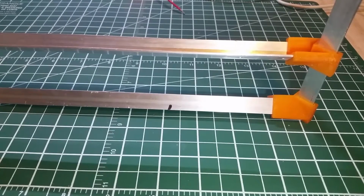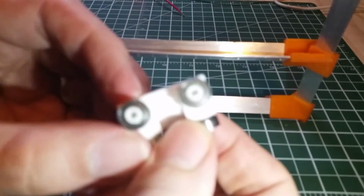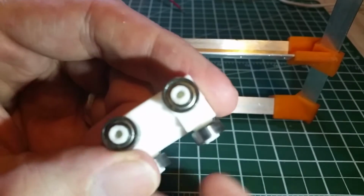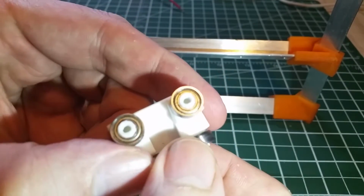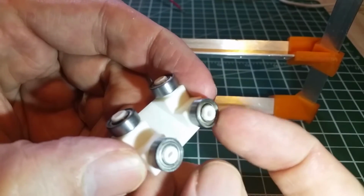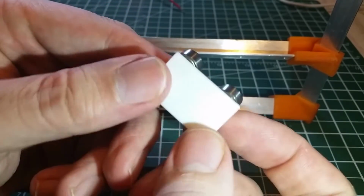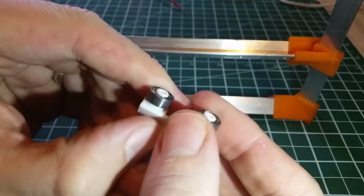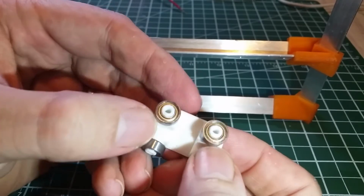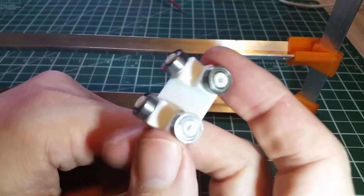One of the other parts I did make with that white PLA, I'm going to show you here right now. If my machine will focus on it. We'll see if it will. There we go. It's not too bad. It's 4 little bearings, 5mm inside, 10.1mm on the outside. White PLA, really freaking strong. I did have to use the PLA at 214 degrees to get it to bond this strong. There wasn't hardly any string. That's the way it pretty much came off the print bed.